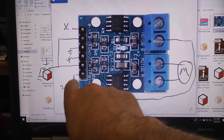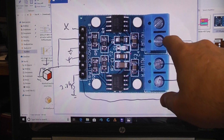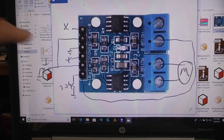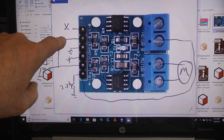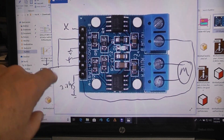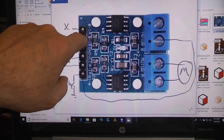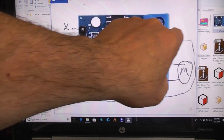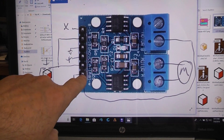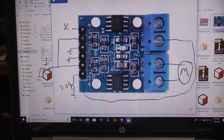We bring the pin that's been forced low up to channel B's input, which becomes high once triggered. Since the channel B X input is high and this one is also high — two highs mean open circuit, so nothing happens there and it stays low. When you ground this pin, you suddenly have a low on one side and a high on the other. Because they crisscross, this high appears on the other output, and we've already changed the other pin to low by pushing the button — so that reverses the motor.